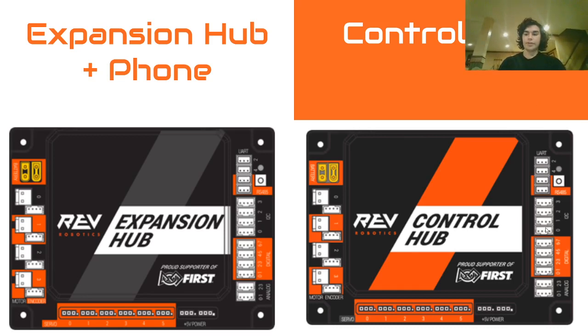These are I2C ports, which is a protocol to communicate with sensors. And so you can buy sensors that will interface with this. These ports are for digital sensors, and these two ports are for analog sensors. There's also 6 servo ports and 2 ports that just output straight 5-volt power.